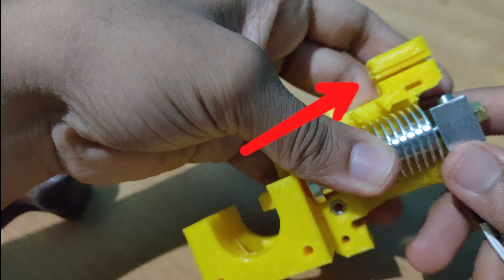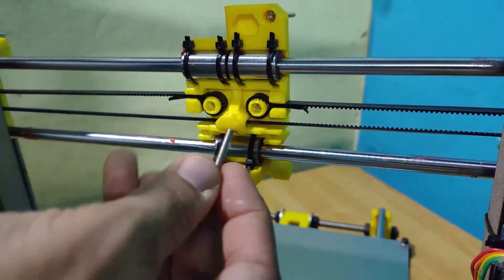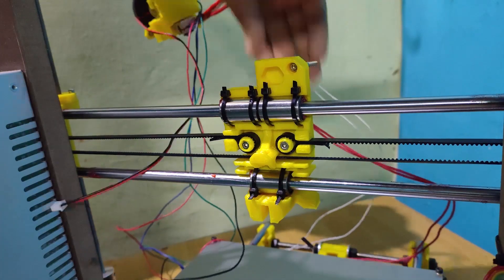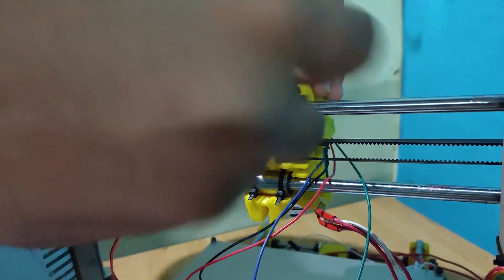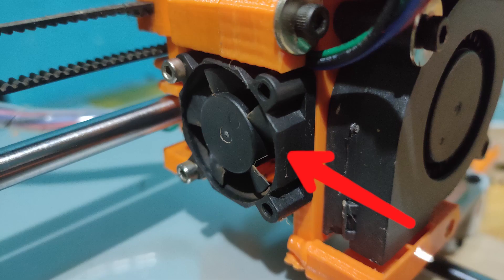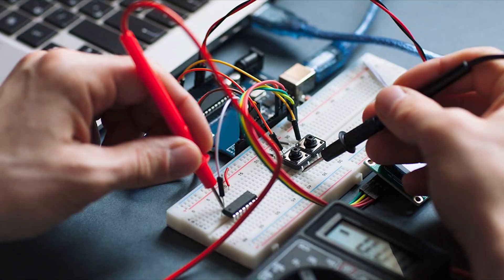A small note: I made sure to include the latest revision of the printed parts. In the latest revision you can directly screw in the probe sensor, which makes calibration so much easier. Now place the screws at various positions on the X carriage as shown, then guide the extruder cables, followed by positioning the extruder properly. Finally, secure it by tightening these three screws. You can also take some time to do some cable management at this moment. Also, do not forget to add the small side fan. This completes the mechanical assembly — we can now move on to the electronics.